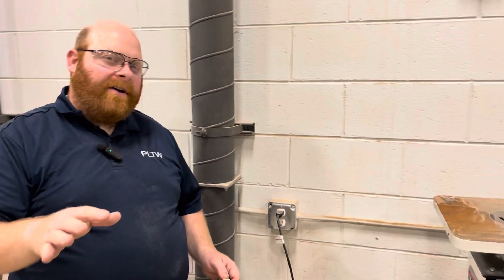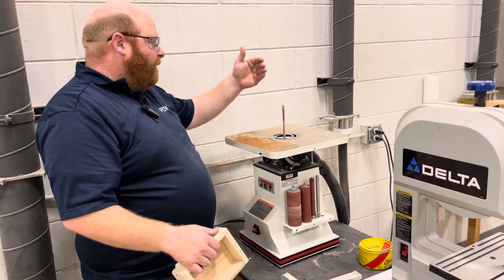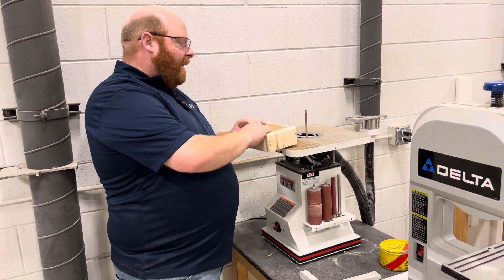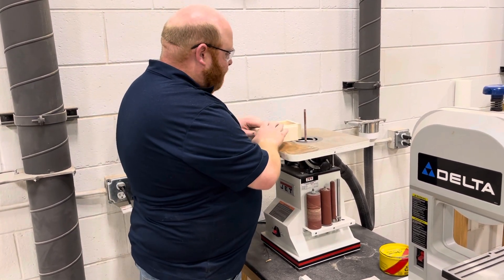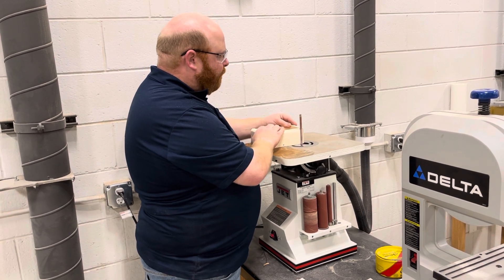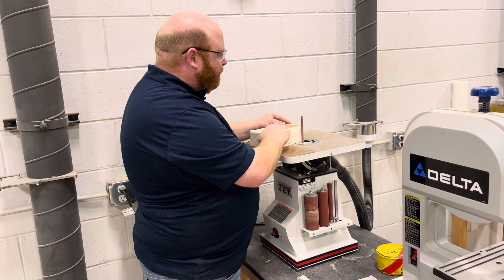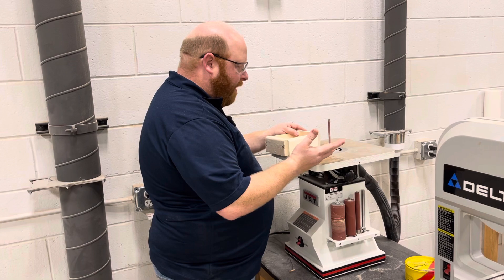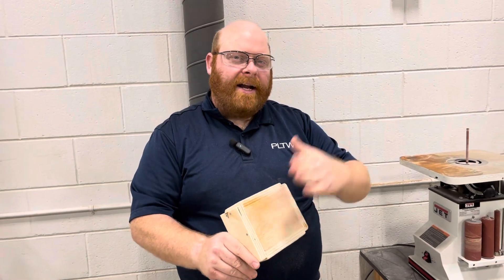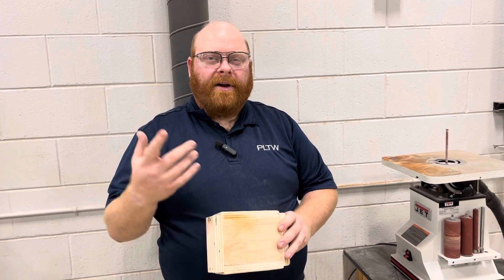The last sanding tool I want to show you is the spindle sander — we don't use it very often. We have different sized discs that go on it, and it's a round spindle that goes up and down, allowing us to sand rounded edges and other intricate pieces. Make sure it's at optimal speed first. Two hands — you apply your piece to the sanding disc and guide it, not force it, so you can get a nice rounded edge on a corner. Take your time working with it. When you're done, wait until it's completely stopped before you walk away. Always get rid of any imperfections, pencil marks, pen marks — anything at all so your project looks as nice as possible. That's all our sanding tools. If you have any questions, see one of us and we'll see you in the next video.